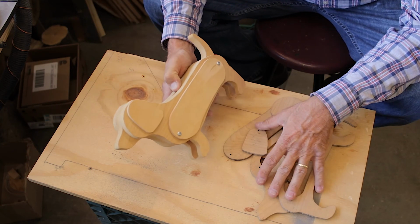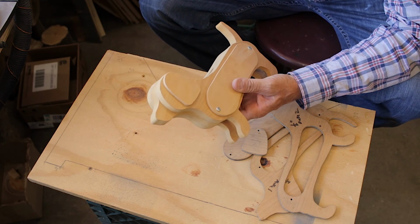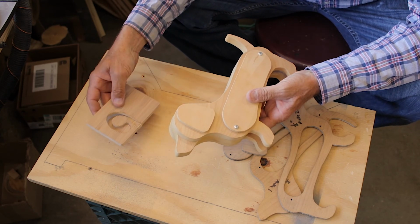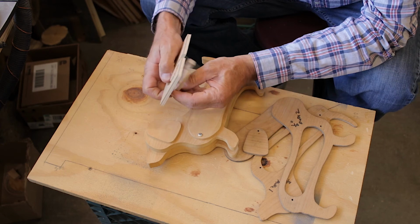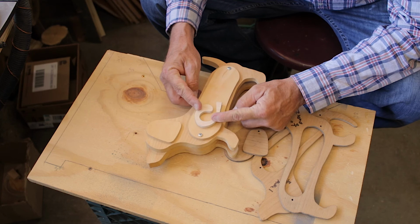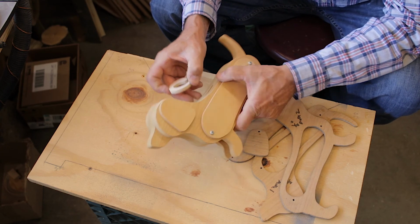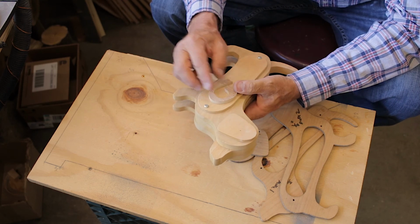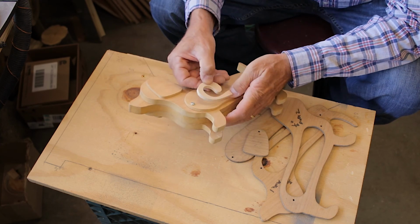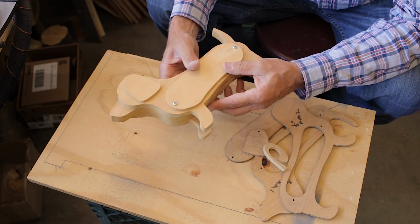When you put all of it together, all of the splintering sides that we talked about, now this one was obviously the worst because I wasn't trying to be careful, but all of this, if I turn it the correct way on my project and glue it down, you don't see those splinters. Then if I wanted one like that on the other side and I didn't cut it in mirror image, this is what I would end up getting. That's why I want mirror image, so that it shows like this on both sides, clean. Less sanding, less work, and it looks good when you're done.